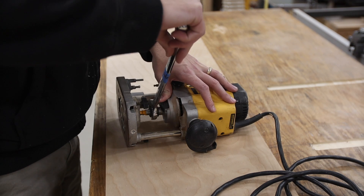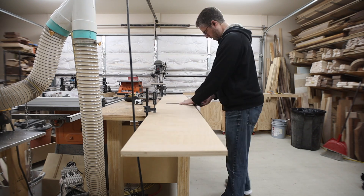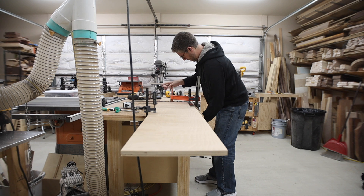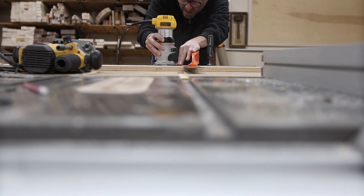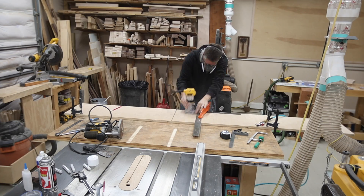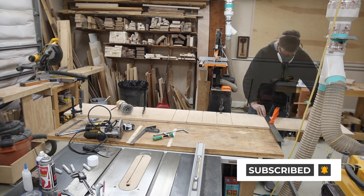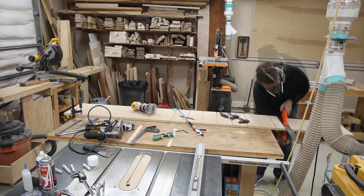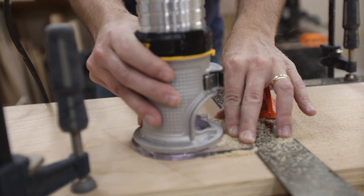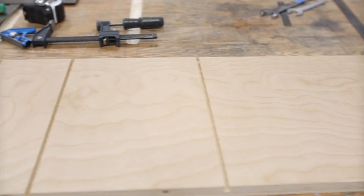You can use a regular dovetail bit and that will work just fine for this system. Micro Jig does have their own dovetail bit which features a round over at the top. They also recommend pre-cutting all of your grooves with a quarter inch bit — this just helps remove some of the bulk of the material and makes the dovetail bit not work so hard. As for groove spacing, I just eyeballed where I thought I'd most likely use the grooves. Since I don't have a router table, I clamped down a straight edge and made each cut with a trim router using the quarter inch bit for relief cuts, then came back with the larger router and the actual dovetail bit.